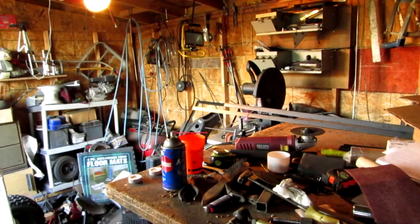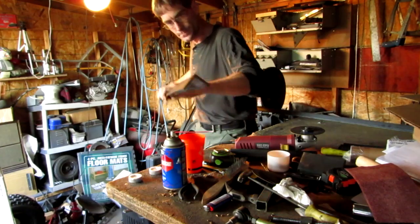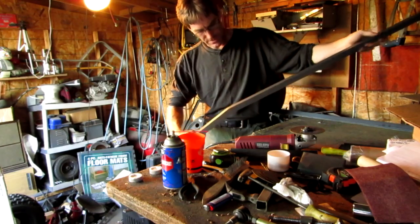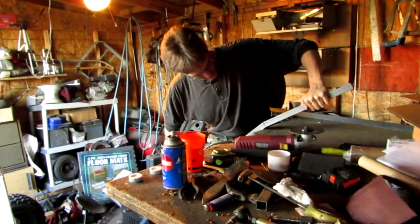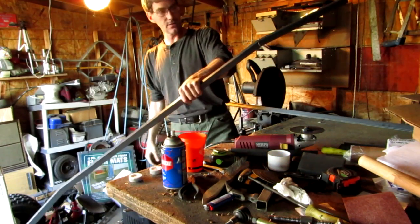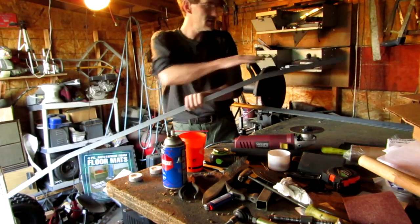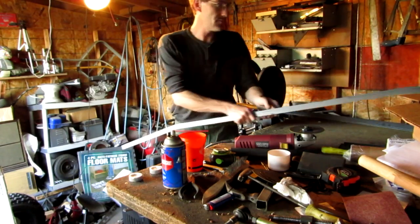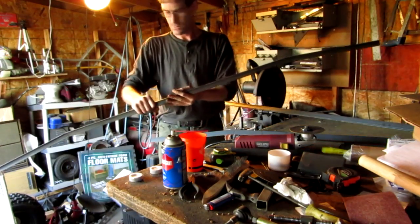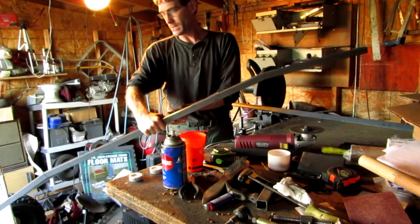Okay, now hopefully you guys can see this. But now I got the steel. Bent it. Now I'll have to tack those, weld those, so it's going to come out at an angle like this. Now by doing the same, measuring the same distance from over here, 16 inches, and back here from 16 inches, I'll be able to grab another one here, I'll be able to have two that will face each other, and they'll be at an angle like that.